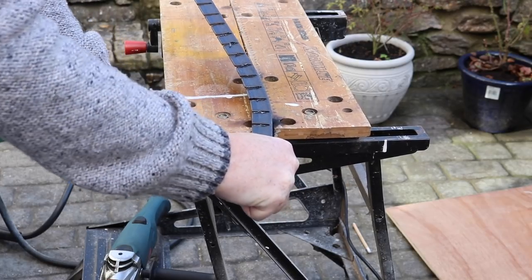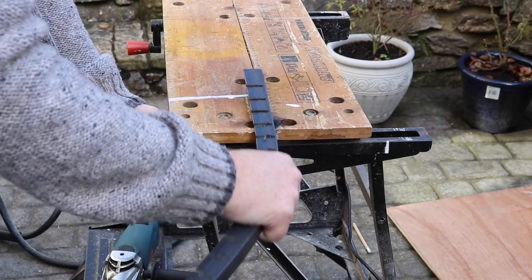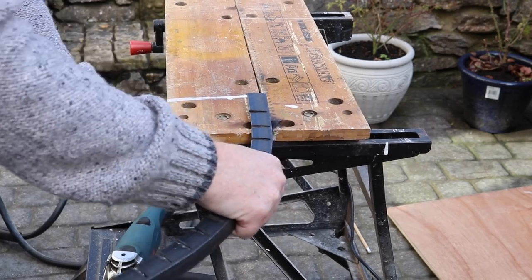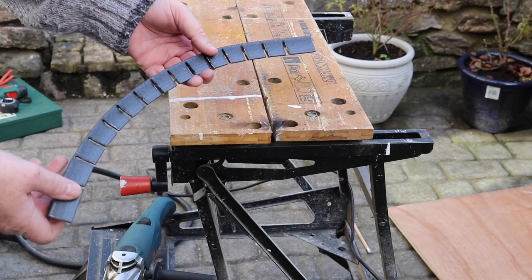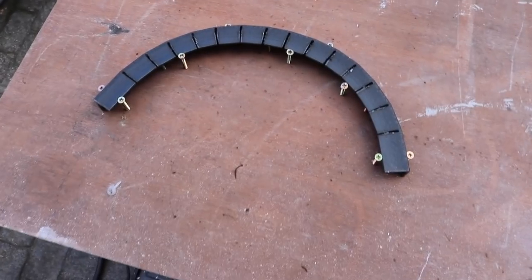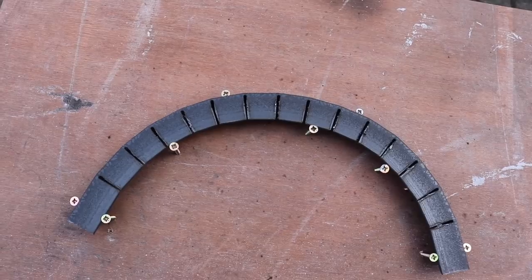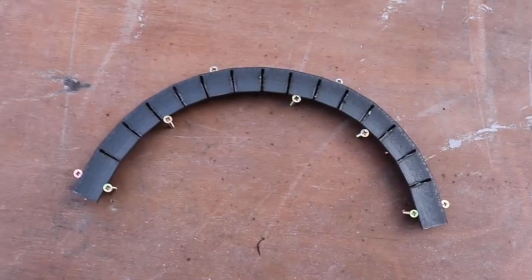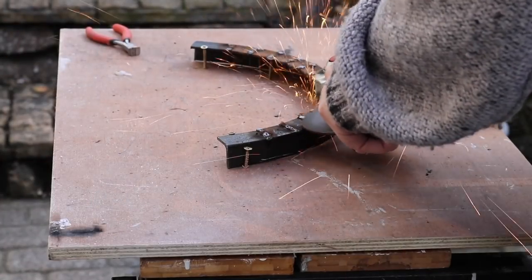So you just keep going — if you've cut through enough it should be quite easy to bend without a great deal of effort, as you can see I'm not putting too much effort into this. I'll continue doing that until I've got the right bend, then check it against the diagram. There you go, it fits. Then I need to weld them up — when you weld, the heat will make the iron move, so I'll put screws in either side to hold it in place so it doesn't lose its shape.